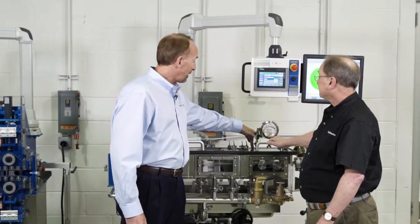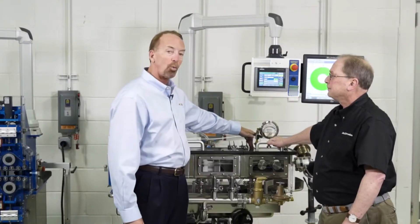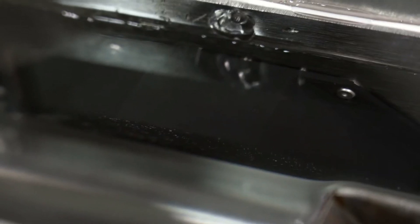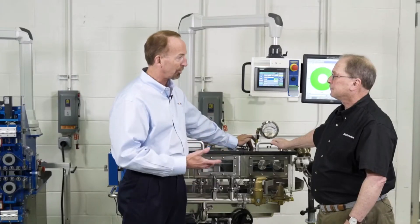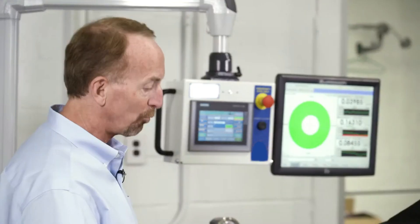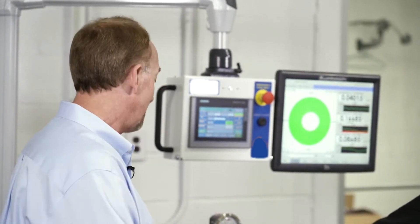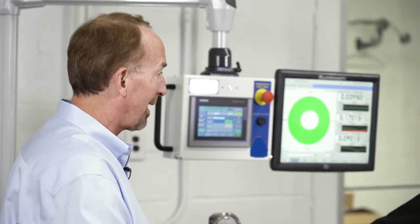Another area we added while talking about the front of the tank is we created the water diffuser system. We wanted to improve how much water we could get and thus achieve better heat transfer, because a lot of people free extruding really had such a low volume of water. They weren't getting good heat transfer and thus they had different temperature gradients within the tank.